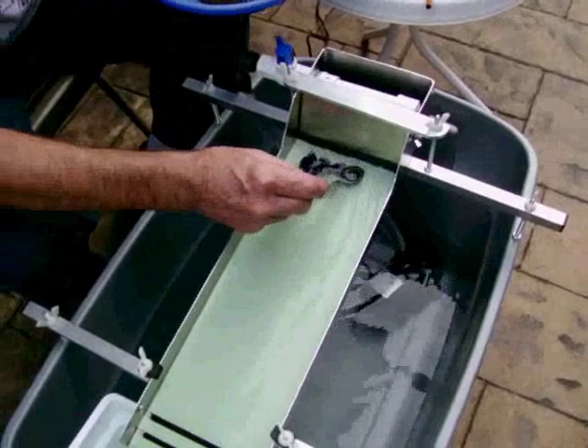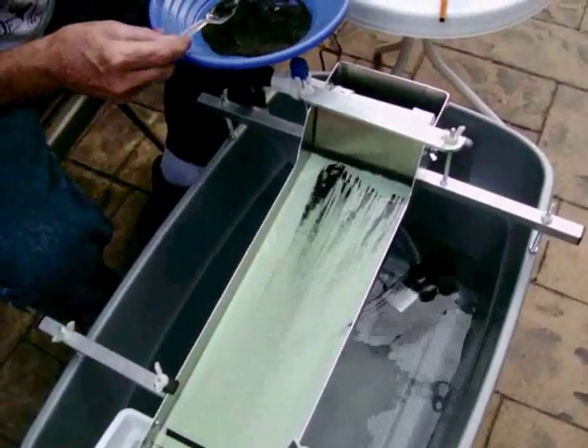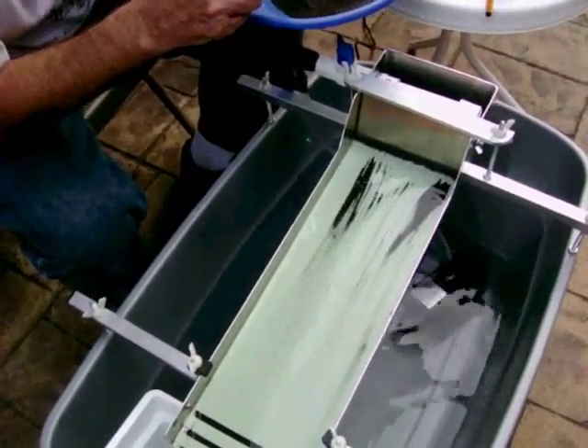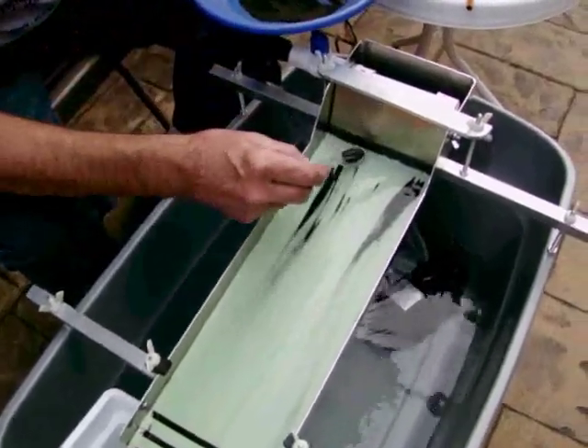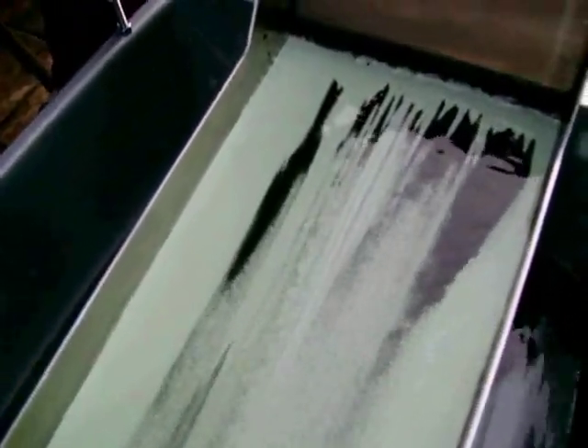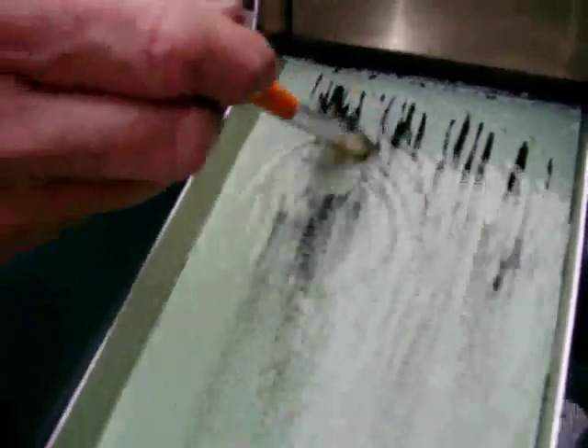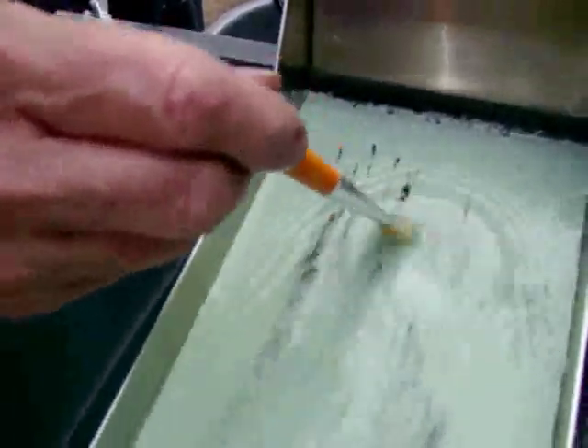Now go ahead and continue feeding our concentrate in here so you can see the recovery action. This black sand, by the way, is magnetite — mostly magnetite, which is very heavy, and very difficult to recover the gold out of. People try to pan it out and they end up losing a lot of the fine gold. This will not lose the fine gold for you. It will all stay there on the Miracle Green mat. The micron fine gold that would happen to wash away would get caught down here in the fine gold tracks. So you can simply slow the water down, cut the angle down, and rerun the product to get that micron fine gold. You don't have to worry about the gold washing away. You can use your brush to agitate the sand — all it does is speed up the whole process. You won't lose any of the gold. The only thing that washes away is the black sand. There's all the gold, nice and clean for you, ready to put in your bottle.